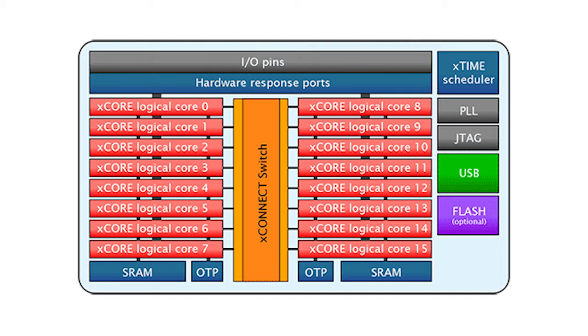But the magic happens here at the center of the kit, where the XMOS X-Core 200 USB interface chip performs efficient audio conversion between these various audio formats while ensuring quality sound reproduction with up to 4,000 MIPS of compute performance. The X-Core 200 features a dual-issue pipeline architecture consisting of 16 32-bit cores connected by an on-chip X-Connect switch that acts as a high-speed network, as well as up to 1024 kilobytes of on-chip SRAM.